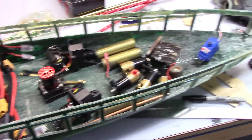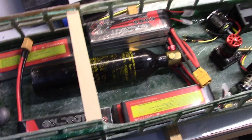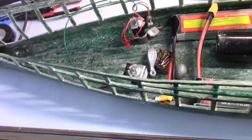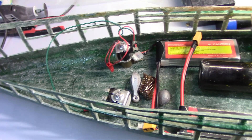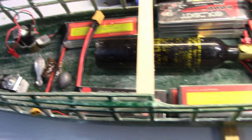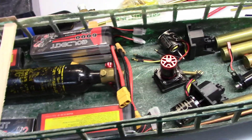Other things you could do at this point: consider weighing the boat, especially if it's a smaller boat where you're worried about the weight margin — for example, if you're not sure about how many batteries to use, what size bottle, or whether you can have accumulation tanks. There are obviously a lot more components not included here: the drivetrain, drive shafts, rudder, rudder mount, water channeling, deck, superstructure. So you don't really want to be up against your weight limit. But it'll give you a notional idea of how many batteries you can use.